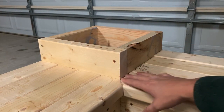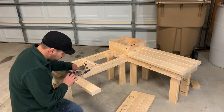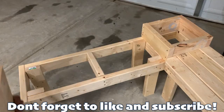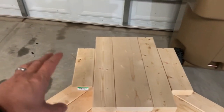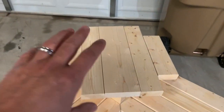Now you can see why I actually used a two-by-six in here — because I'm going to create a top for this, that way it's like a little seating bench. I had to go with a two-by-six down the center because two-by-fours, unfortunately, wouldn't work. They were just a little bit too short on the ends, and I didn't want to put a real tiny piece on the end of where the corner is. Two-by-fours ended up ending right there and that just wasn't going to work. So I went ahead and opted for a two-by-six to go right down the center — that kind of made it symmetrical.